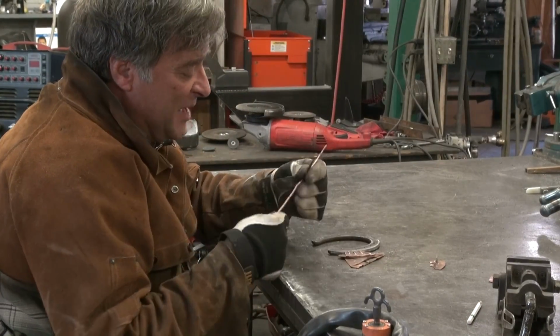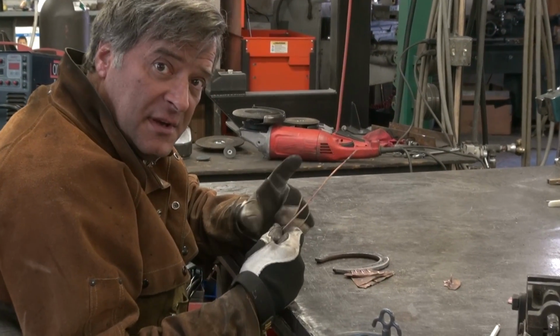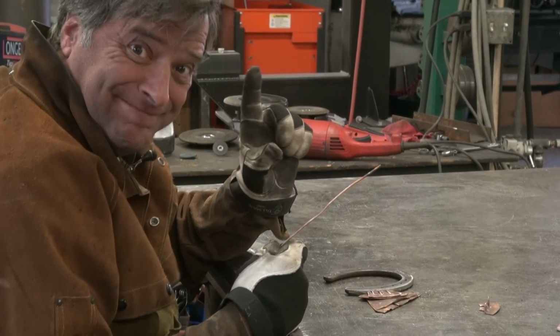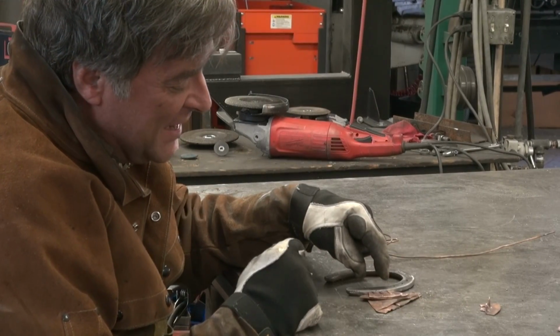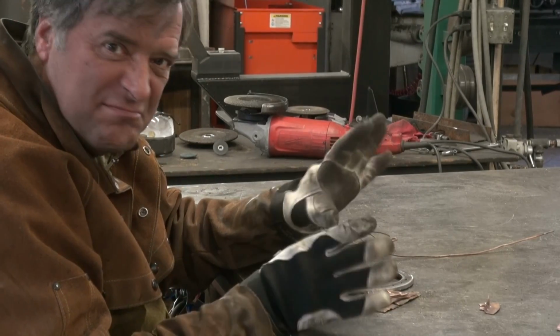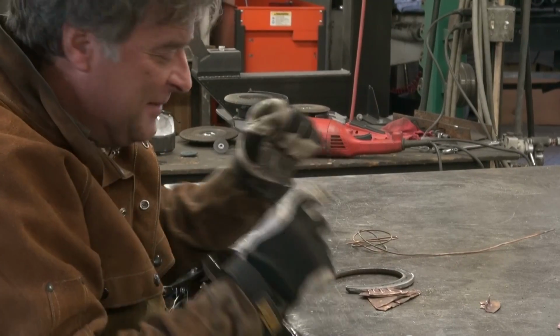this is actually the best welding rod that I have found for doing copper with. It's Romex house wiring. It works great. I don't know why, but it does. So that's what we do. Just heat it up, get a little puddle going, little dab of the copper, work it over, tacks up, just perfect. And then I'll show you the other way.